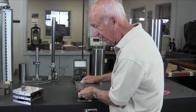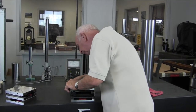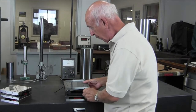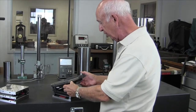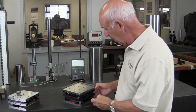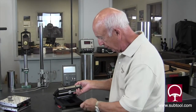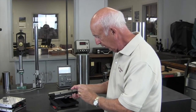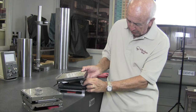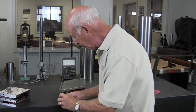On the Excello, the hinges themselves lock, putting pressure in the downward position to prevent movement. It puts pressure towards the gauge block or the work surface. Your gauge blocks go under here — we have a one-inch block and we're going to stick it under the pad. You'll also notice there's a precision pad here that's lapped and a precision surface here. We'll slide that on, get it into the right position, and then lock it down. Let me take this apart and show you what it looks like inside.